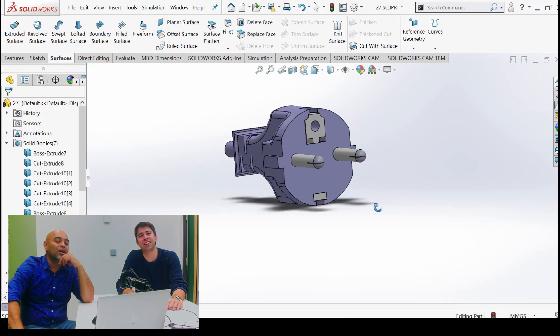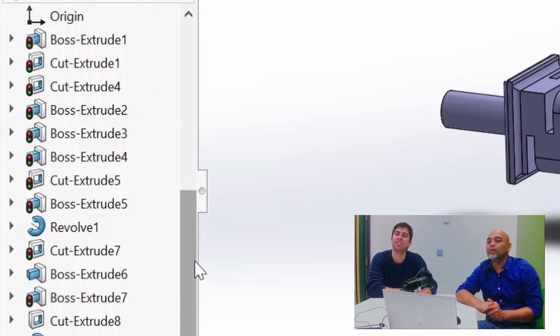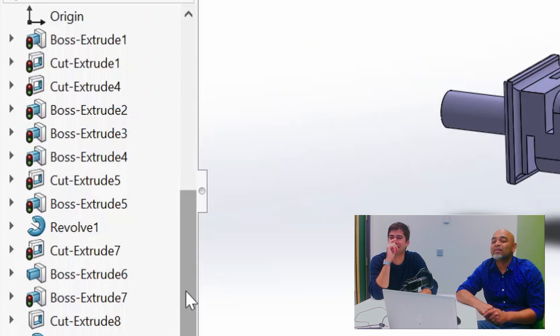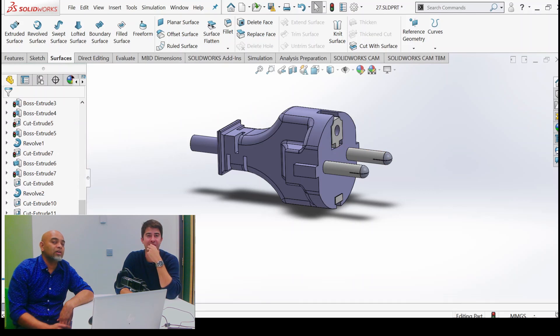Being a European plug not used in the UK, there's a bit of unfamiliarity there. Now, this is interesting — it's really done well. Everybody's got one of those — just sit down, take it apart, measure it with the caliper, and reverse engineer. The only thing concerning is all these features are just called Boss Extrude 2, Boss Extrude 3. Obviously for the guessing game that was useful, but in practice you should rename your features. It's a very simple part but there's still so much work going into it — so many details. Even if you have a very simplistic part, that doesn't mean the CAD is simple. Try modelling a spoon.